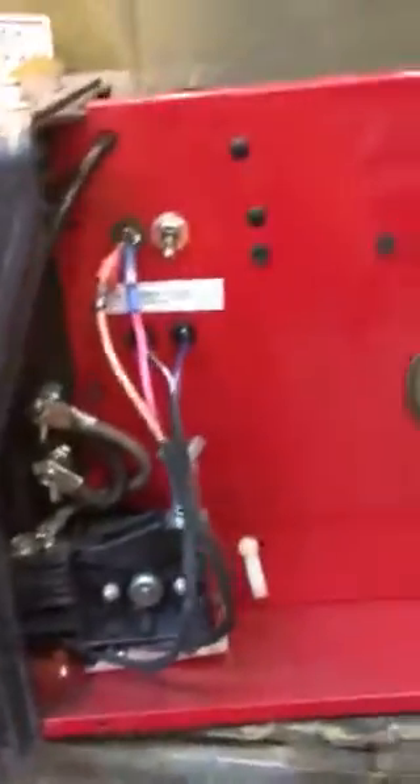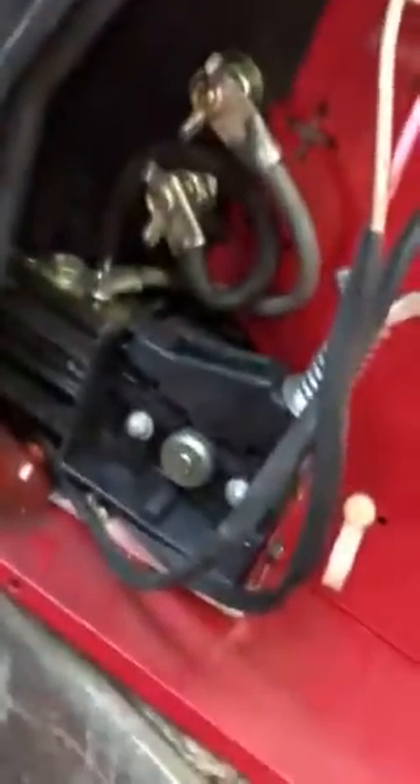Then you have to steal the other wires to run your drive motor. Basically disconnect this one and put it to that one — that's what the switch does, it switches power from this one to that one. That's really the only thing you need to switch. You've got to make sure it's going in the right direction — check your spool, make sure it's in the right direction. This looks basically pretty simple all said and done. Pull the trigger, you can see it running a normal wire.